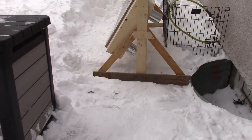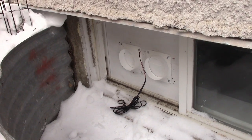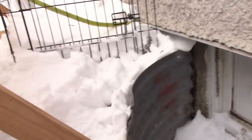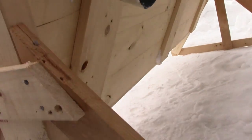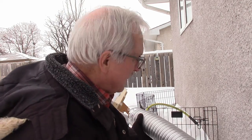Let's look at the outside now. Here's the collector — you can see I've got my outlet on the left and my inlet on the right, and I'm going to hook that up to these pipes. To keep it simple, I'm using flexible pipes with just a couple of 4-inch hose clamps and 4-inch flexible aluminum pipe. I saw another video where a guy said just use what you have, and I actually had some left over from venting out a bathroom fan. So I'm going to hook that up now — hopefully it's long enough, but I think it'll work.